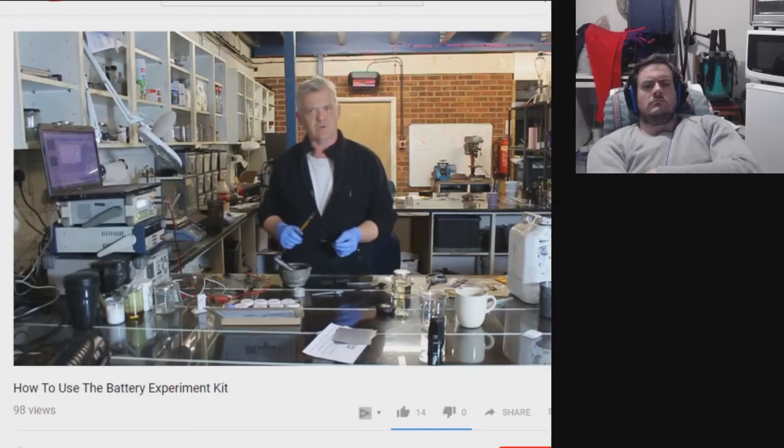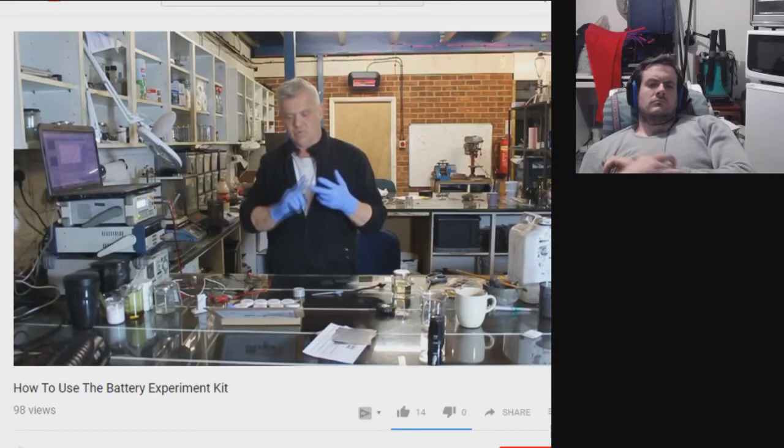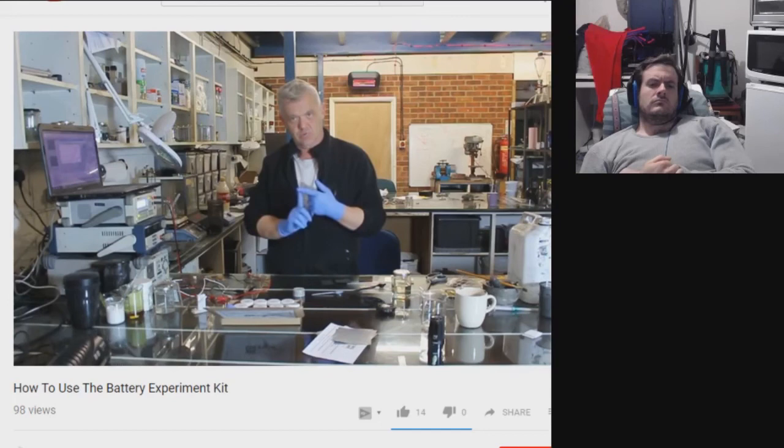When you're making those inks, it's the same process, really. On the basic level, you need your ink, the conductive additive, a binder, and a carrier. So the binder is the CMC, the conductive additive was the graphite, the metal salt that we used was an oxide, which was vanadium pentoxide, and the carrier we used was water. Give them a grind round. The longer you grind them, the better it's going to be, because it's all about dispersion. It's all about getting those things thoroughly mixed.